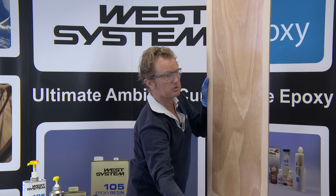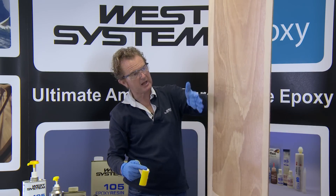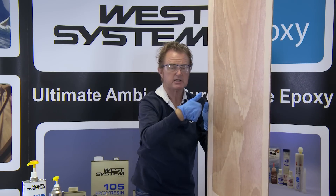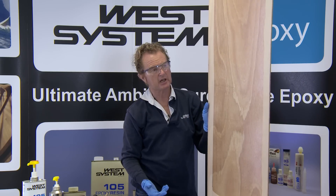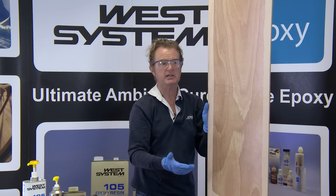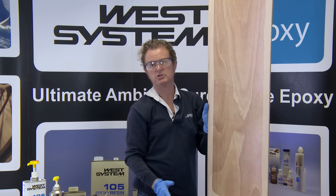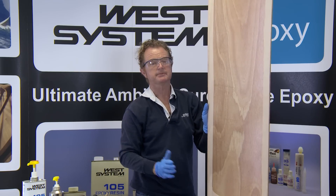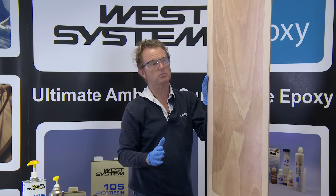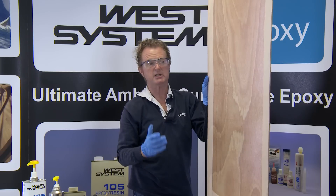I'm being careful to tip off every single square centimeter of the coating to get a nice, level, evenly distributed epoxy coating. I'll leave this to tack until it becomes as sticky as masking tape, then carry on and add another coat, repeating the process until I've built up three, possibly four coats. Then I leave the whole coating to cure — possibly until the next day — and lightly abrade it with 180 grit paper, nothing finer, before carrying on with a two-component varnish system with a good UV inhibitor for clear, very durable wooden parts.